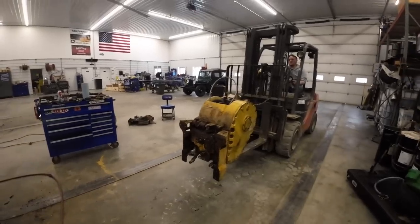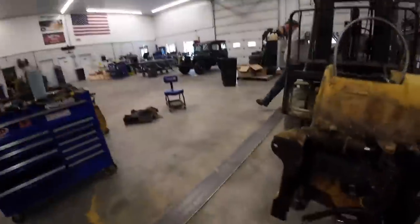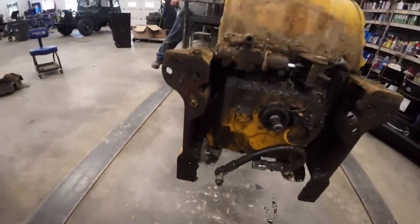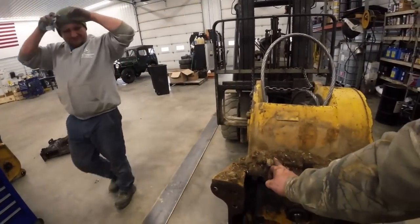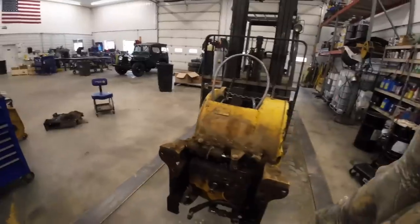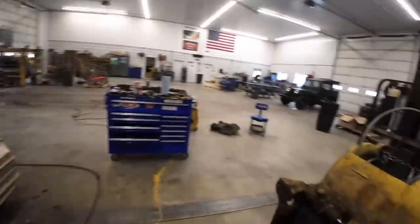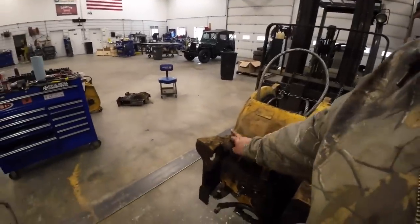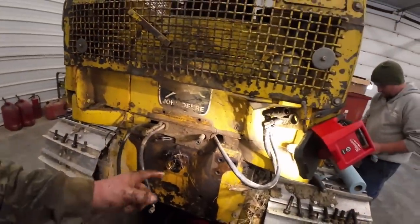There's the big hose I took off underneath — that's just a return oil line. Pressurized oil goes in the other port. This is a little different because it has a power in and out. If it was just a free-spool only, it would have one feed line and one drain line. We're going to cap that stuff off and clean this up before we pull the back plate off, because we'll be exposing the transmission. We're going to use the little Giraffe Tools pressure washer — they sent us this thing. We've had it maybe six or eight months and it's holding up good.